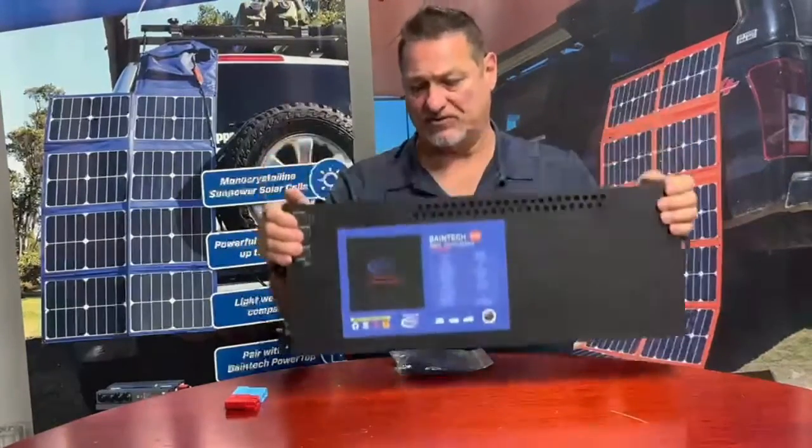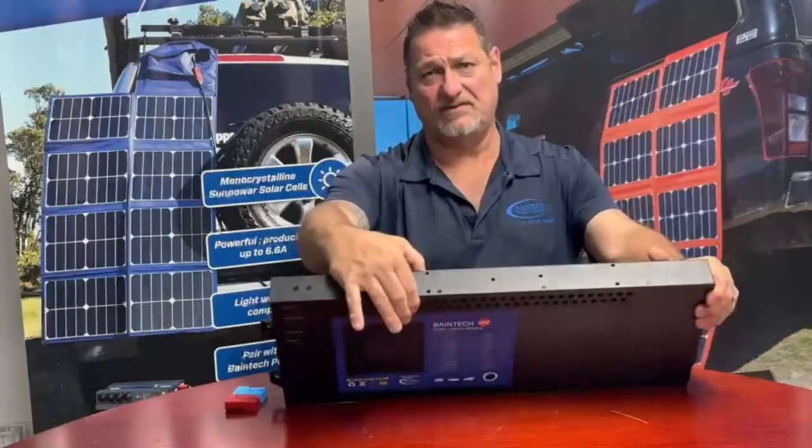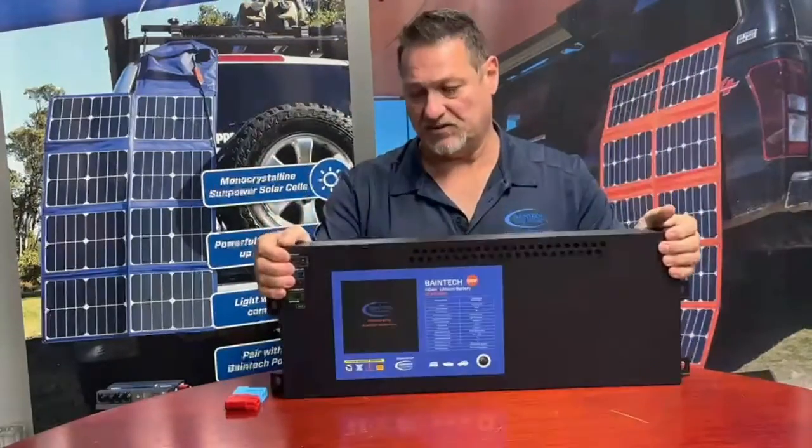Still a nice lightweight battery — it's under 15 kilos with everything built in. The exciting news is it's built into exactly the same case size as our original one: 620mm long by 250mm high by 50mm thick. It's still only 50mm thick. There are a couple of other ones on the market now but they're still like 60mm thick and up to 300mm high, which just starts getting too big for the really tight spaces this was originally designed for.